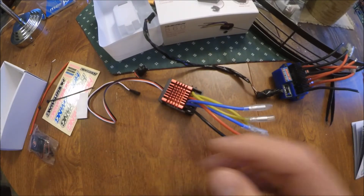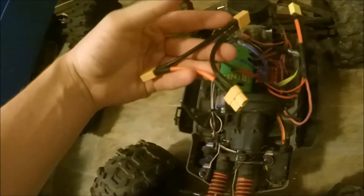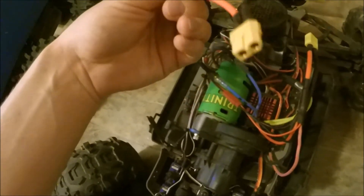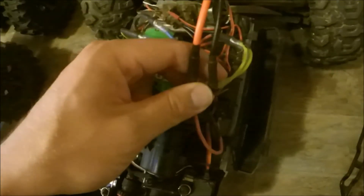We're over here at my first Summit and I'll show you how it's installed in this big mess of wires. First things first, this is the series adapter I made for my two batteries — all you really have to do is Google it, it's pretty simple. This basically turns your two 2S batteries into one 4S battery, so it comes into here and then like I said I have a bunch of other stuff tapping off the 16.8 volts of a 4S battery.